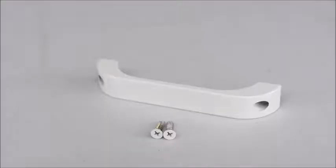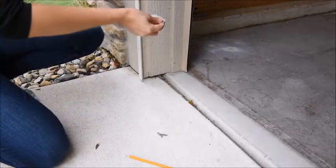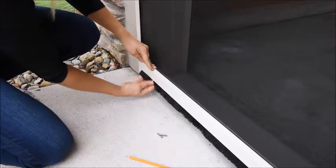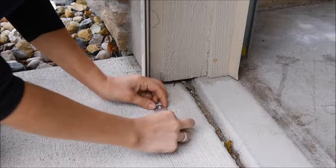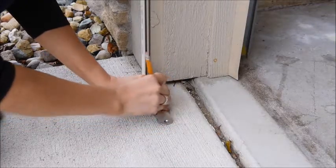Use the number 8 one-and-a-half pan head screws to attach the handle to the front and back of the crossbar. Next, install the strike plates. Place the strike plates on the magnets which are pre-installed in the bottom of the crossbar. Now, with the strike plates in place on the magnets, close the panorama light screen and mark the location of the holes where the strike plates meet the concrete or decking.